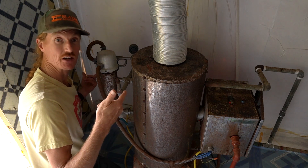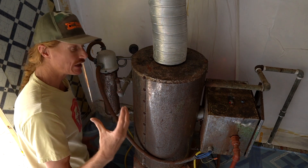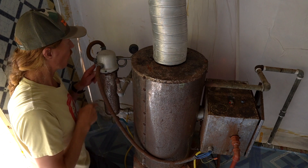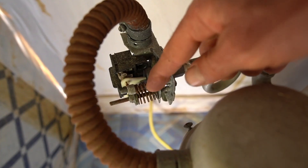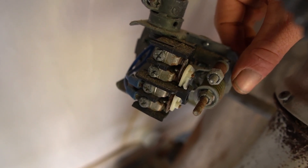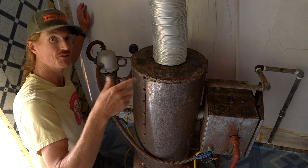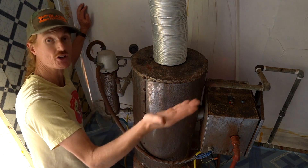It just clicked back on — the pressure dropped to the point where the spring was able to push it back on. You can hear the flame running, heating the water and adding steam to the cooker, bringing it back up to pressure where it will hit the point and the spring clicks off. I'll show you: when pressure rises, this little spring comes all the way up, pushes against the resistance, and clicks off. Then pressure drops over time and the spring clicks it back on. With a boiler like this, it runs off pressure rather than temperature — and the pressure in turn governs the temperature.